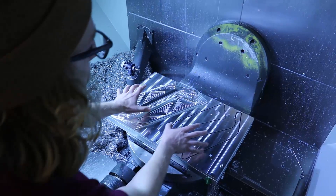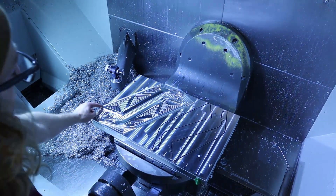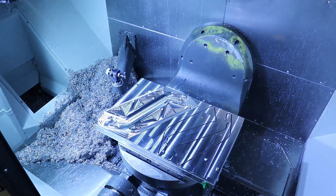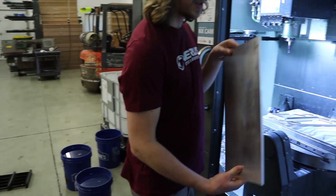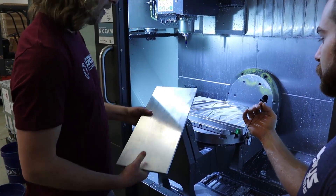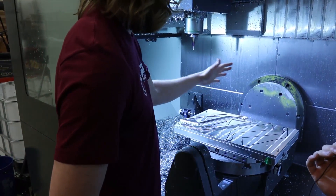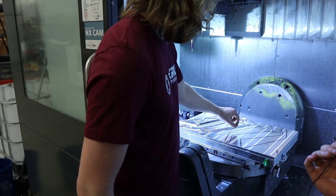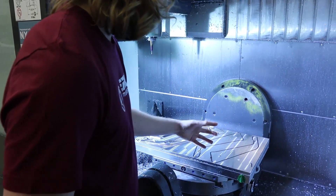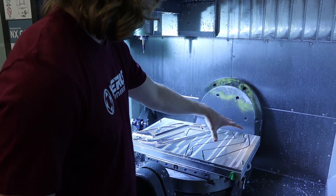As you can see here, the parts are pretty nested in here in a way that the O-rings are just all the way to the extent of the part, and you can see the part hanging off here a little bit. When this flips over onto this side, we've got it hanging off here as well, so it's pretty tightly packed. This is the blank which we put in to get half of the parts out. This goes in on the left side and cuts it, then basically this gets flipped over. You can see the O-ring grooves here — the vacuum pulls the air out through these holes so that all inside this O-ring region, atmospheric pressure pushes down on the part against the plate.